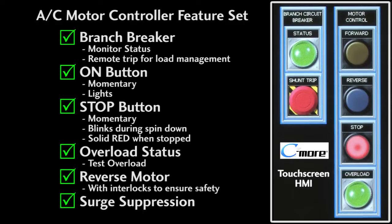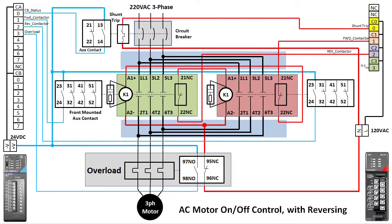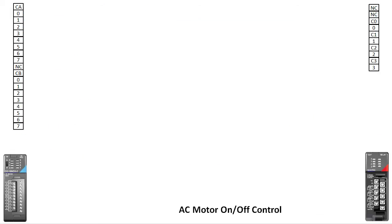That's a little more involved than just turning a motor on and off, but it really isn't that bad. In this video we'll review how all this gets wired together, and then in the next video we'll program an AutomationDirect Do-More controller to monitor and control this reversing AC motor on/off system. At first glance the wiring looks intimidating, but if we take it one step at a time it really isn't that bad. Our controller has an input module with 16 inputs and an output module with 4 relay outputs, and we want to use those to control and monitor a 3-phase motor on a branch circuit.